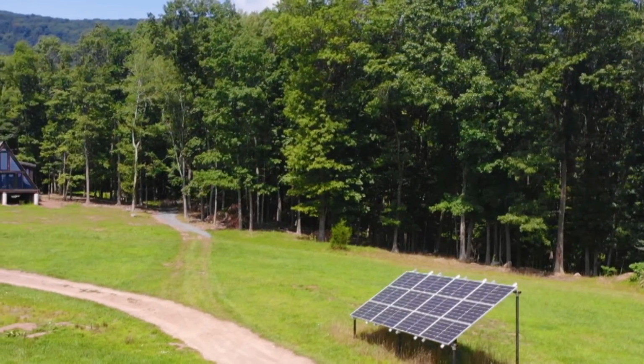We did accommodate for a voltage drop by upsizing our wire from the panels over to our powerhouse. So we are under a 3% voltage drop on that. A common misconception is that we are running 48 volts from our panels over to our powerhouse, and we are actually, due to the way that we wired them in series, running 288 volts from our panels over to our powerhouse.